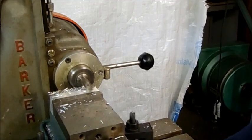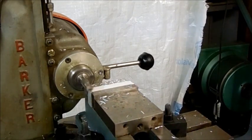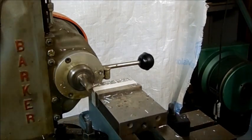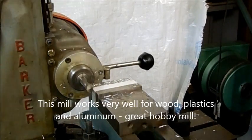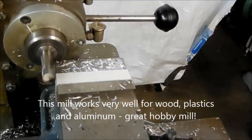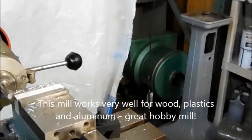We've got quite a bit of extension on the milling bit, so we're not getting a super flat finish. That could all be adjusted so that we don't get this rippled finish, which we've got right here right now, but that's the mill in action.